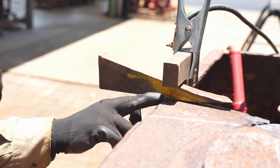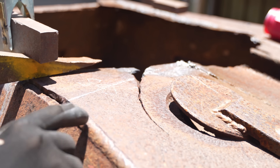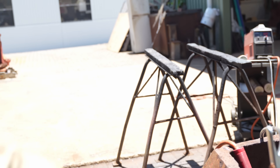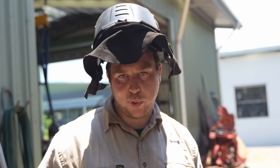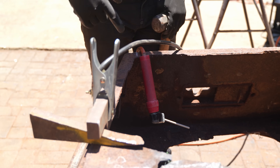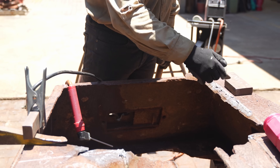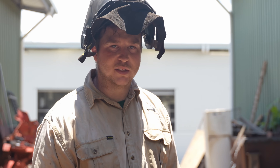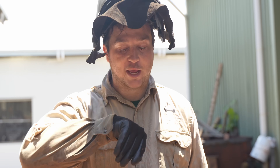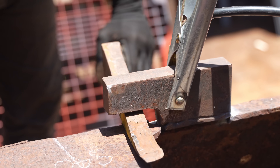You can see now it's touching here, but this one's blown out — so we'll heat along here and try to knock that one down too. Once I get this roof straight, I've cut a bit of plate which will go in and get welded in. Once that's welded in I can trace where the door hatch would be — roughly there — and cut the door hatch out. It's a lot of work but that's originally how it was. We want to make it as original as we can, so we just have to fix all these bits first.